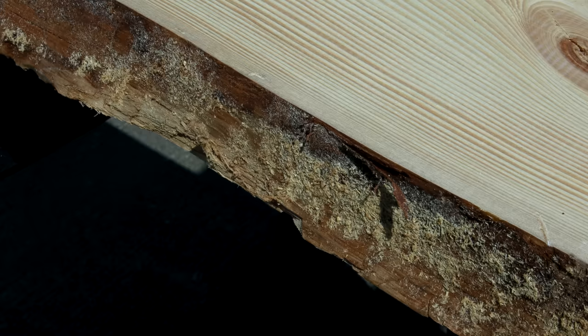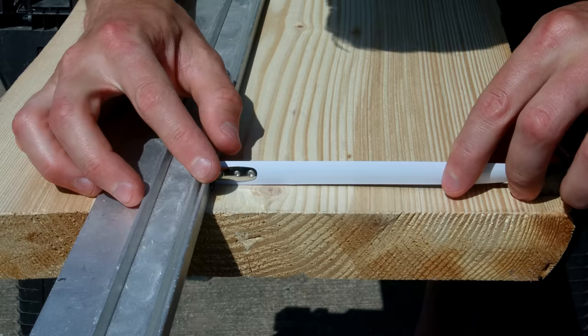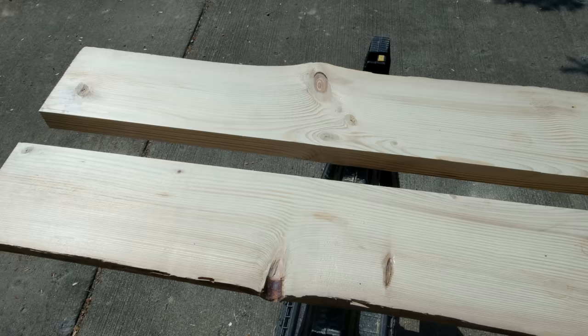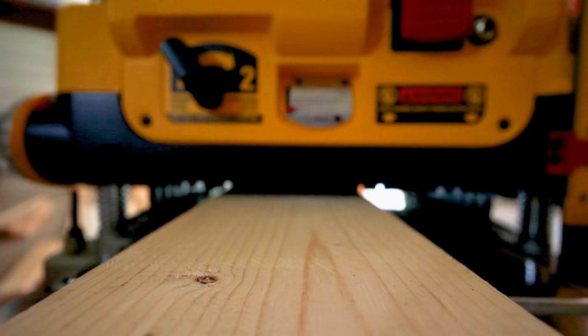The edges were also full of undesirable debris. A wire brush took care of that with ease. My design consists of two parallel slabs with their live edges in the middle, so I ripped the board down the center to account for that. This cut, however, wasn't square. I didn't want to do this so early in the process, but I had no choice — it was just too wide to fit into the planer, which was the solution for the cup.